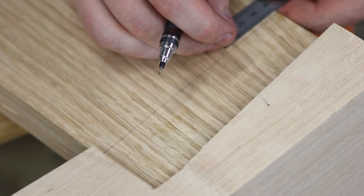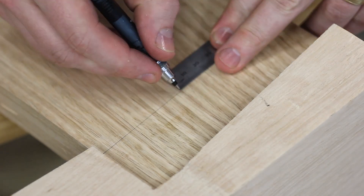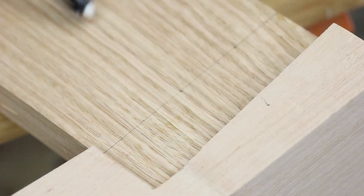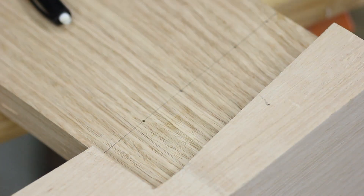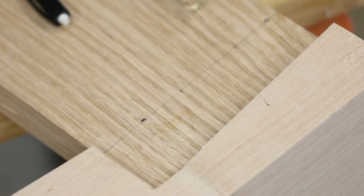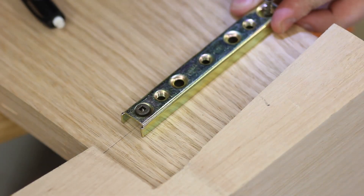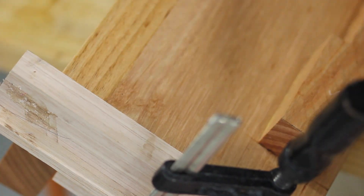To attach the side rails to the headboard and footboards, I'm using an Australian invention — the Maxi-Lock bed brackets. These are non-mortise brackets that attach together using high tensile socket head bolts. The placement for them is fairly fiddly, but with some careful measurements it goes together fairly smoothly. On the rail side it's fairly straightforward — a simple fence held it in the correct position while I drove the screws.